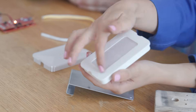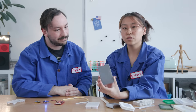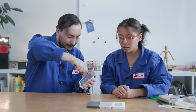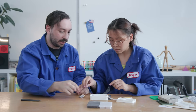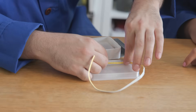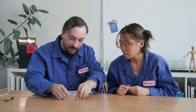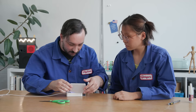Now we're going to attach the rest of the housing with a few different lens options. This one Jesse made really hides the LEDs. This one has a little etched pattern that helps diffuse the light a little better. And our gray translucent with a rough texture hopefully also makes it diffuse. So we'll attach it and see which one's best of the three. The LED is meant to go in the wall of the housing. I should enable the power supply — I just soldered a bridge between the enable pin and ground so it didn't flash on while we were assembling it. This enamel wire was soldered directly to the LED pins on the dev kit, which luckily had a MOSFET already included, so no extra hardware was needed to drive it.